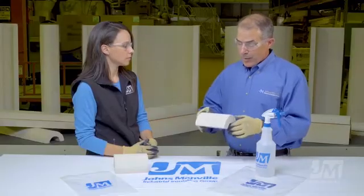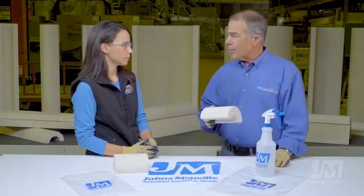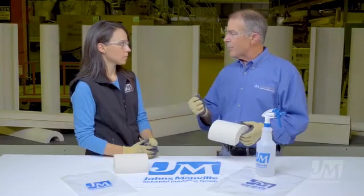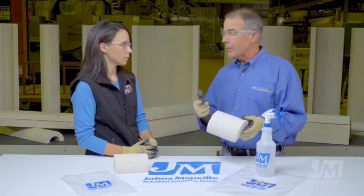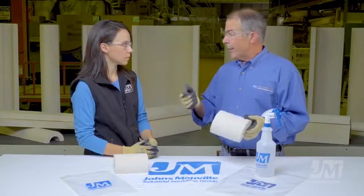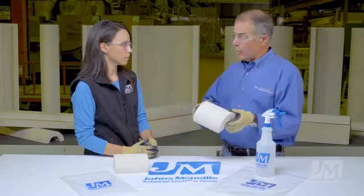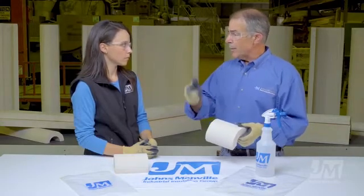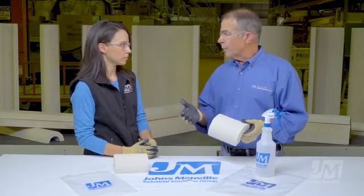Can you iterate to me once more what the benefits are to contractors? The whole development program — the genesis of it — was around the contractor desire to have a product where they don't have to scramble on the job site to get the material jacketed, because the insulators will always go faster than the jacket folks. When it starts to rain, productivity stops, because they've got to climb down off of what they're doing and cover all exposed insulation — whether it's staged or on the pipe — with visqueen to keep the rain from getting the material wet.